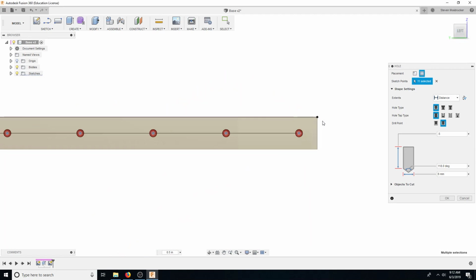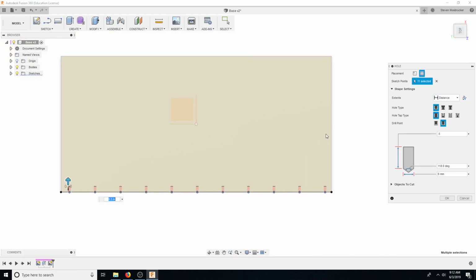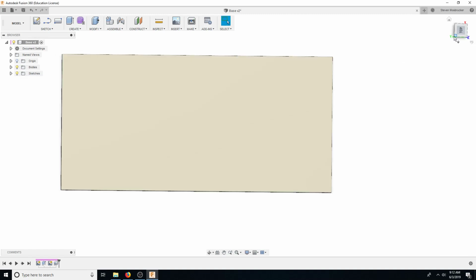The other thing also is that we're going to do T-slots in here, but we don't need to make them that deep because we don't want them to go into these screw holes. Even a 1 inch deep, let's see. Half an inch should be fine. But actually, we need it to have about a 1/4 inch clearance for even a bottoming tap. 1/4 inch, I mean. So let's just do that.